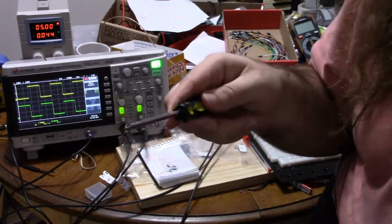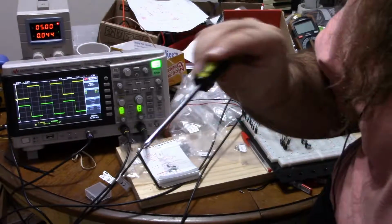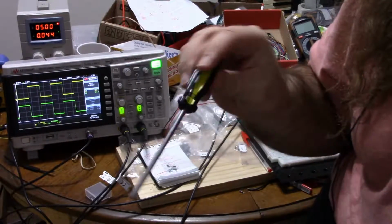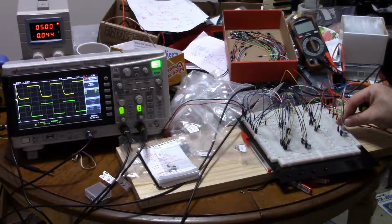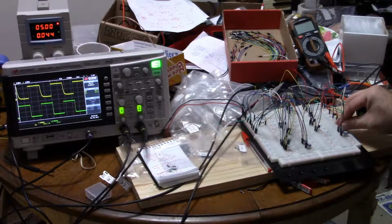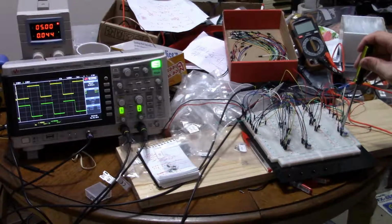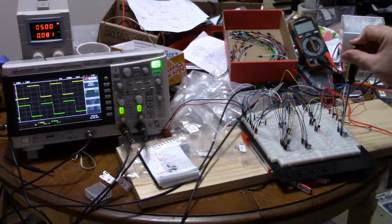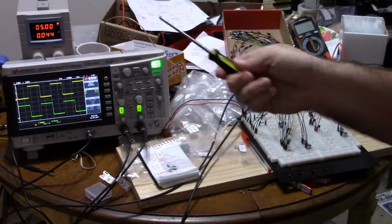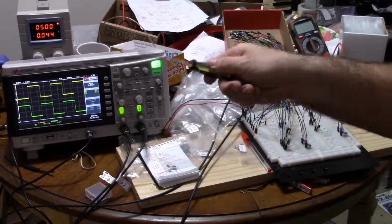So adding it drops the resistance, but then changing the value up and down changes the total resistance up and down like it should, except not with the same proportion it would in series. So when I remove it, I have increased the resistance to just the multimeter probe. When I put it back in, I have decreased the resistance. But now, if I decrease the resistance further towards a short circuit, you can see it starts affecting the system every time it goes into current limitation, but it doesn't affect it until then. Until the voltage of the supply drops, it's not having any effect.